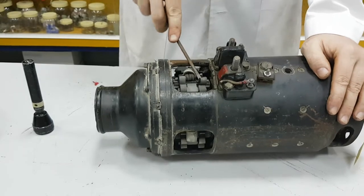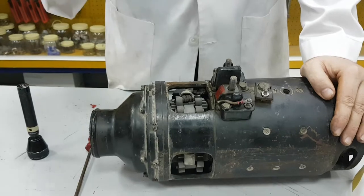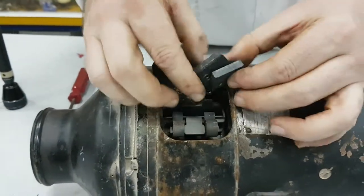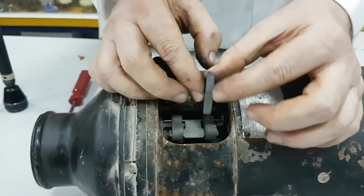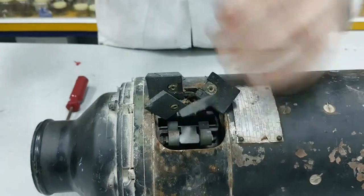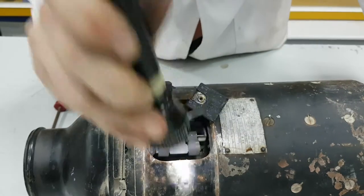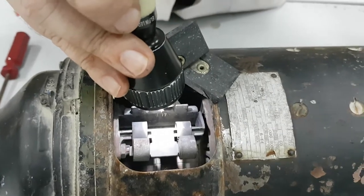That may be done periodically, or it could be done on condition, or to see if we've got a problem. I've removed some brushes here, and if you have a look, it's basically a carbon-based brush. We're inspecting to make sure that we've got plenty of tread left. Within the context of the aircraft maintenance manual, we would check that. We'd also do an inspection to have a look on the commutator, and you can see in tight there that there's no wear in that commutator. And we can rotate the commutator to make sure that there's no damage. This one's pretty old.